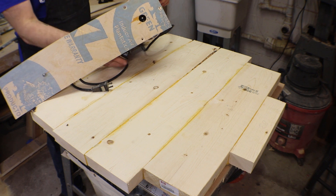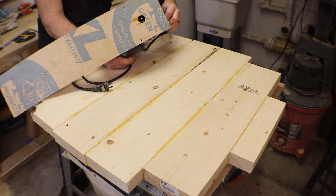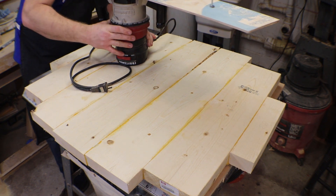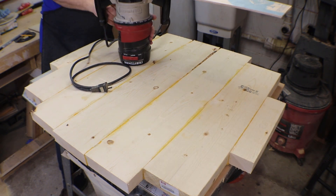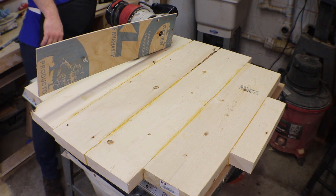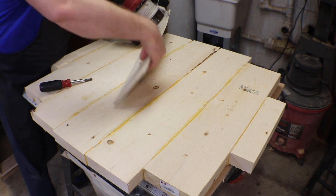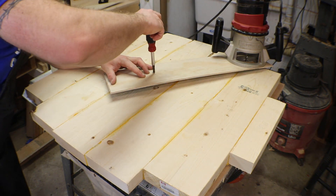I've taken the template, drilled the holes out where the screws go, and put my two screws in. I have only two. The router bit — you just don't want to protrude it too much. I'm starting off with a really light pass, only letting it protrude out maybe a quarter inch, just to make sure it's smooth and going to work. For the center screw, I've used one with a smooth shank on it and two washers just to keep this from binding up too much. I'm going to center that on my hole and screw it in place.